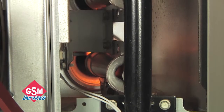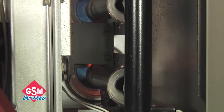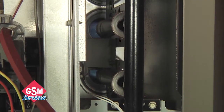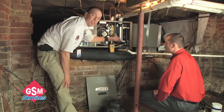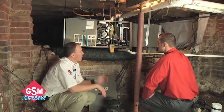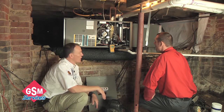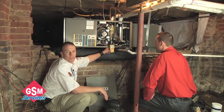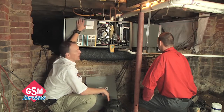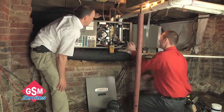You can see the glow right here — that is the hot surface igniter. When the gas valve is activated, we'll see 3.54 inches of water column on the manifold pressure. We're going to look at the flame and be sure it's a nice constant cone shape going into that heat exchanger. Jason's going to monitor that flame because after 30 to 60 seconds the blower is going to come on and start blowing air. At that point we want to monitor the flame to be sure we don't see any variation, which tells us everything's safe. Once it fired, the reading went down to 3.49 — it is in a safe operating range and it is where we want it to be. There goes our blower motor — it just came on, so I know all the sequences of this furnace are operating properly.